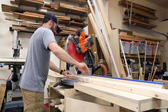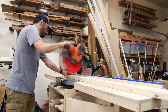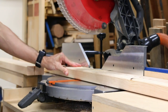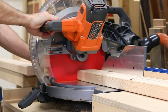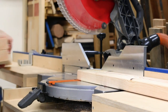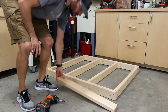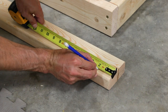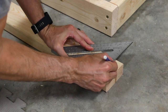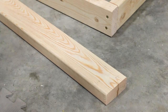After I got the frames made I cut four legs to length to connect them. I'm using 30-inch legs which, when paired with my casters and a half-inch MDF top, is going to give me a table height of 34 and a half inches — you can adjust that for your height. Each leg is connected to the frames with three screws. I laid out marks for two screws that go into the long grain of the side and one screw that goes into the end grain of the front or back. You don't have to lay it out this way, but it looks nice.